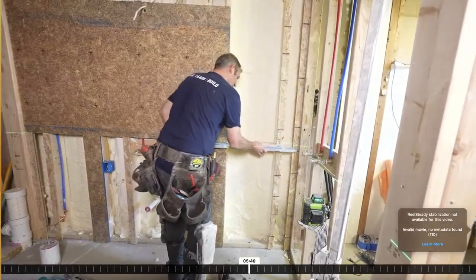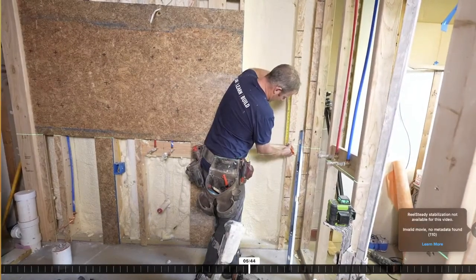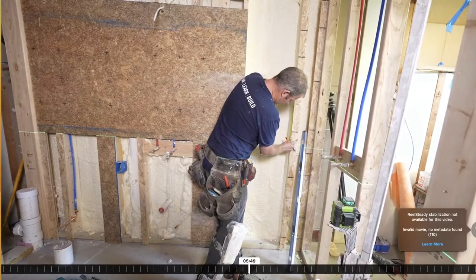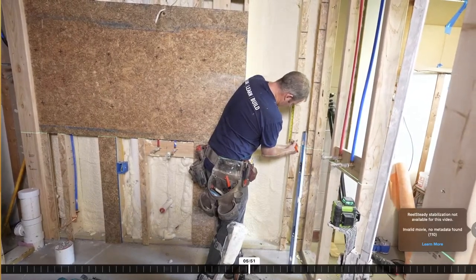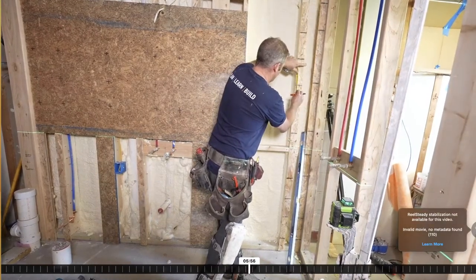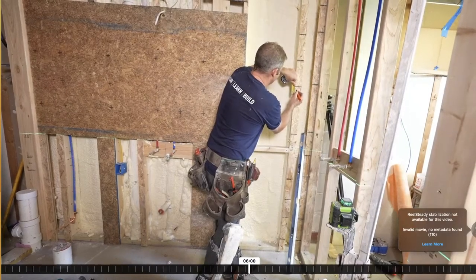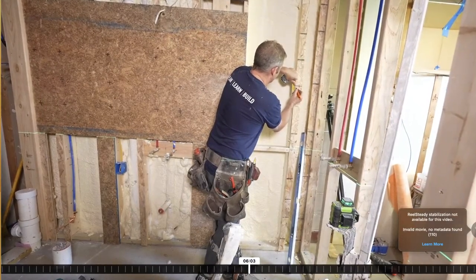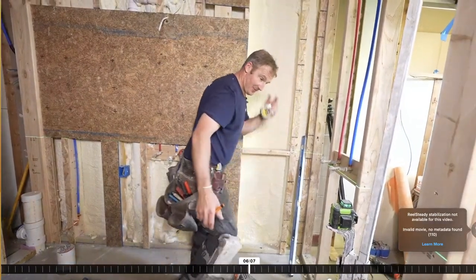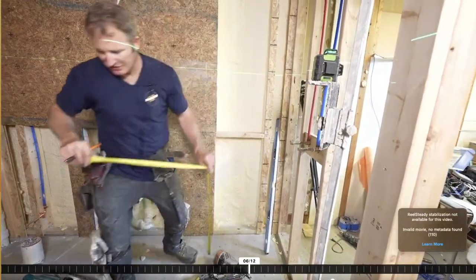Okay, so just make sure everything's aligned. As far as the height goes, try to make this 16 inches for the tile, and the backer board, an extra 1/2 inch for wiggle room, and a 1¼ inch countertop. From here, we want to be 16. Then with our tile and our backer board, it's going to be another inch. Again, let's give ourselves another inch of room, so 2 inches. So off of this framing, 20½. That should be where our tile layer is actually 59 inches.